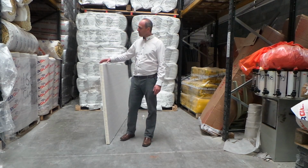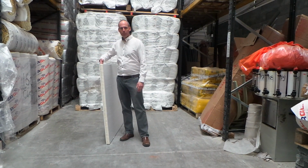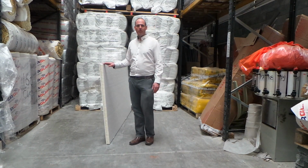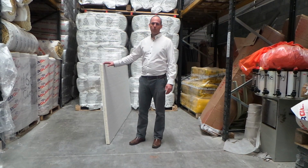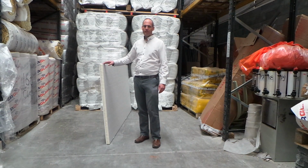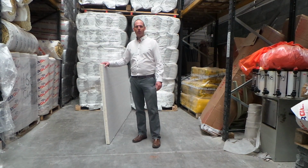for that. The makeup of this board is generally a gyprock plasterboard on one side with a polyiso board on the other side. So again, this is very similar to the Celotex PL4000, the Ecotherm Ecoliner and the Warmline. Other variants of this board are available with a gyprock plasterboard with EPS, XPS, or even a phenolic insulation on the side. But for now, we're going to look at the polyiso version.